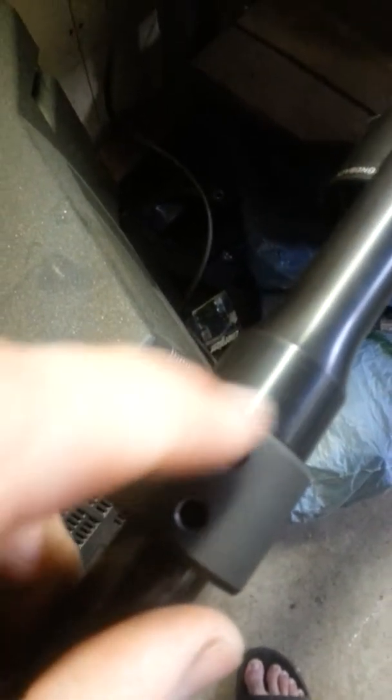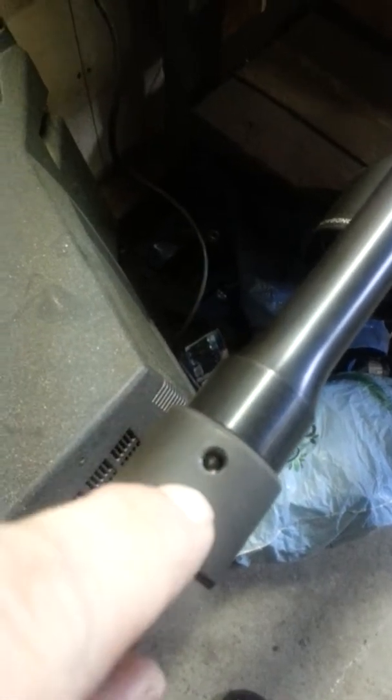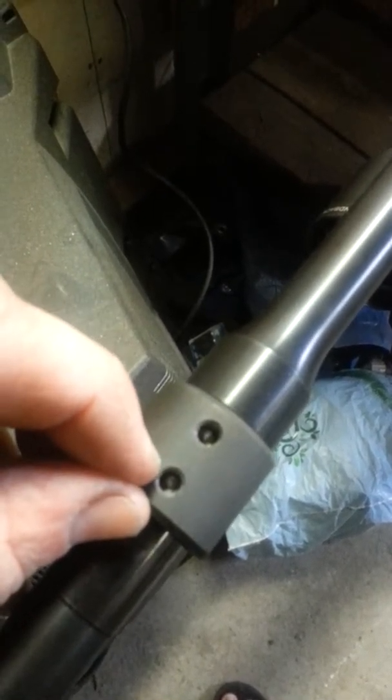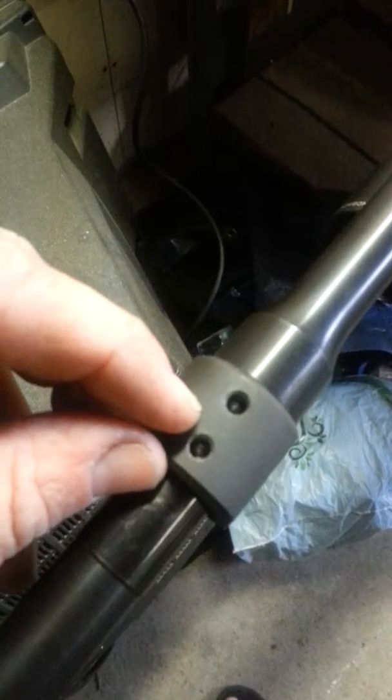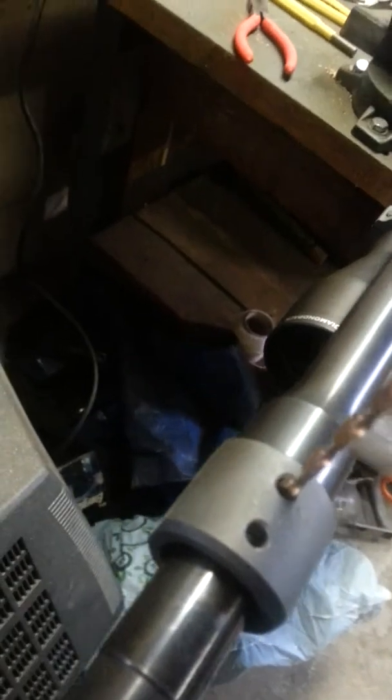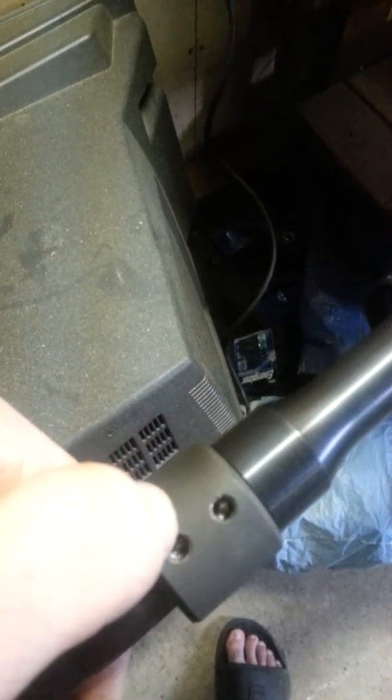You're going to have it perfectly lined up for your set screws for most gas blocks. At least it'll get the first dimple perfectly straight. Most gas blocks — I forget the distance, center to center I think it's like 0.54 inches — so it covers all those gas blocks if you want to do both dimples like I did, but most people would agree one dimple is probably good enough. Then once you have that lined up, get your drill bit, put it directly inside the port, and hit it. If you want to do two, do that as well.